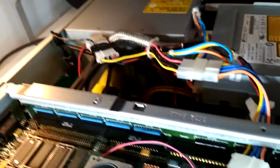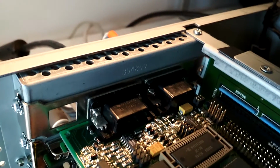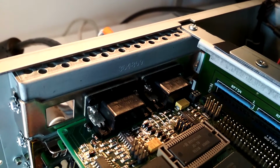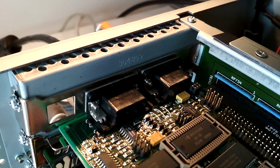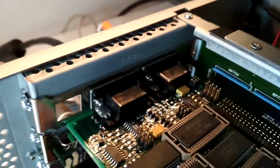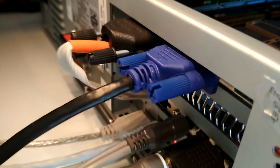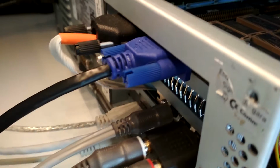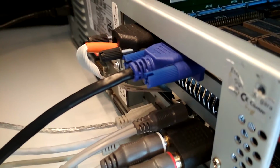Another nice feature is that there is an output port. So there's no need to use any additional video mode switchers in order to display the native Amiga modes on a single monitor. As you can see, I have a VGA monitor connected to the CyberVision, and from my Indivision scan doubler, I forgot to mention it, there is a cable which goes to the CyberVision 64 output. So when I'm displaying the native Amiga modes, it switches automatically between the CyberVision modes and the native Amiga modes.